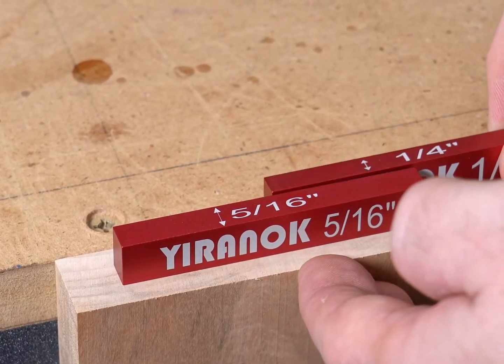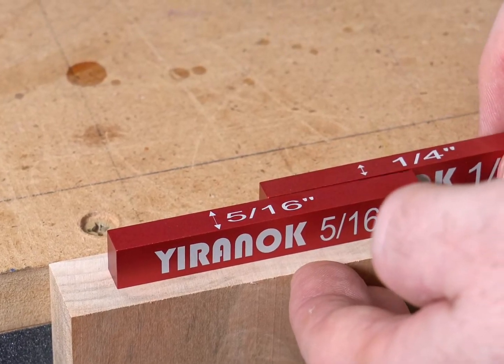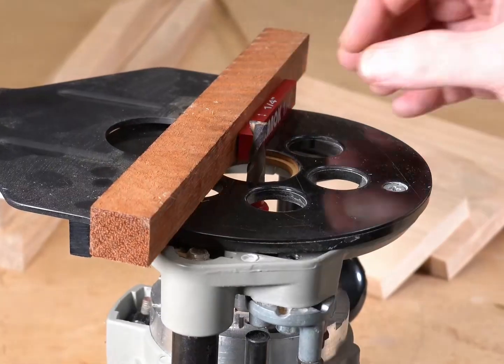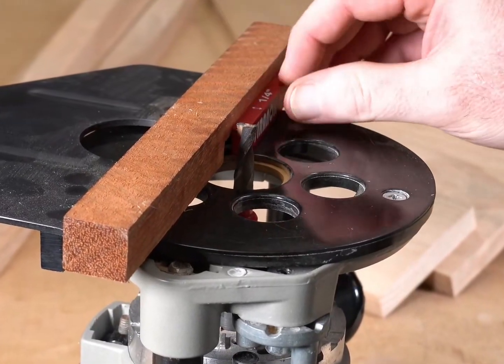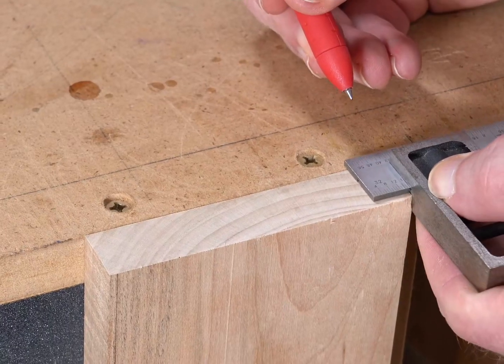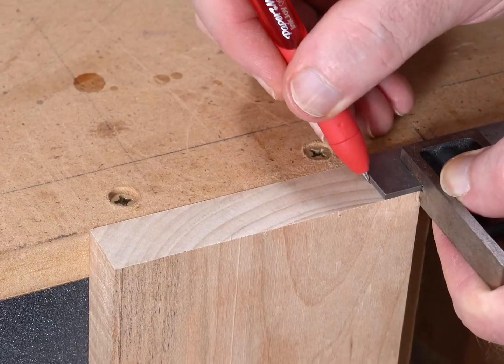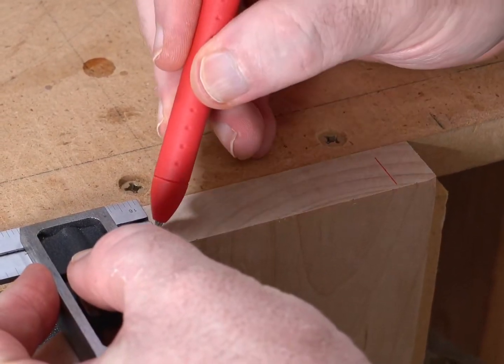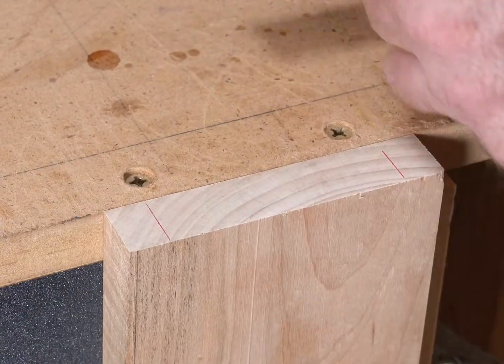I'm going to do a 1/4 inch shoulder on the face of the rails. This isn't exactly centered in the rail stock, but it's close enough. I used the 1/4 inch setup block to set the router fence. I'm keeping the mortises a 1/2 inch in from the edges. Getting too close to the edges can compromise strength, and since I still have to bevel the rails for the 5-degree splay, there's no reason to flirt with disaster.